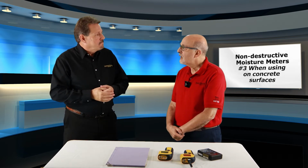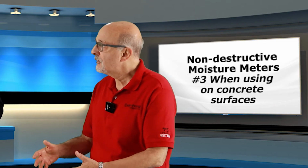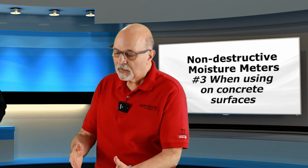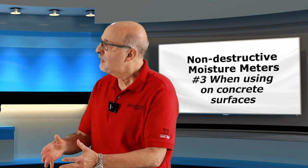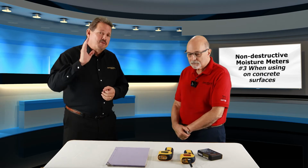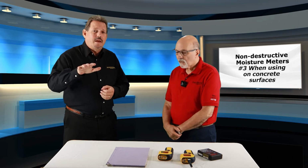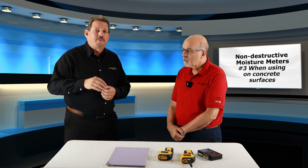That's right. There are certainly a lot of variables in the concrete that will affect the reading from one job to the next. So, in effect, you're using the meter and setting the standard for that particular job before you move on to the next one. Excellent. And one thing about concrete, folks, remember, ASTM now has a designation out there for your concrete comparative testing.